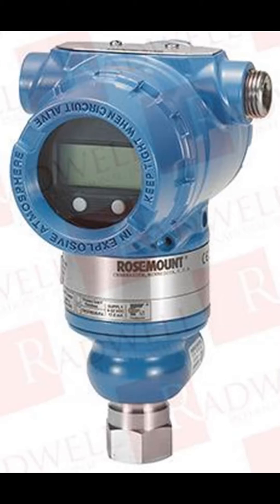In this example the pressure transmitter is set from 0 to 4 bar, so the electrical signal output will be 4 milliamps for 0 bar and 20 milliamps for 4 bar. In this demonstration we're going to check if the transmitter is working correctly, calibrated correctly, and giving the correct electrical output signal for the pressure applied.